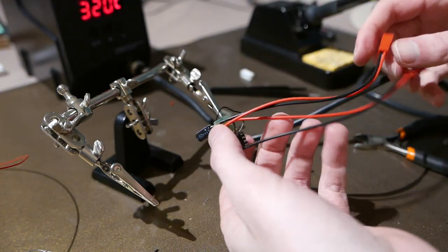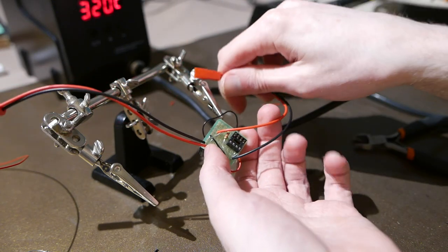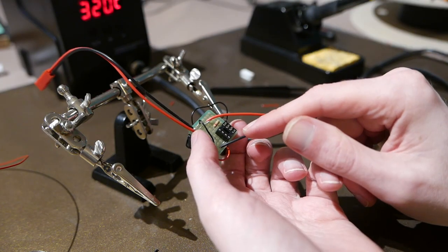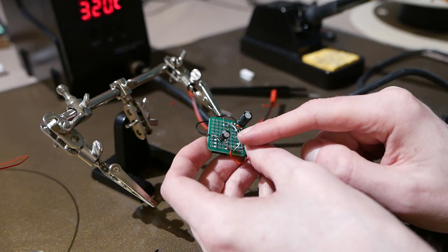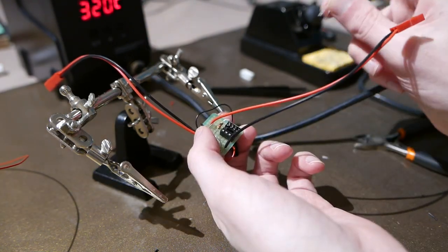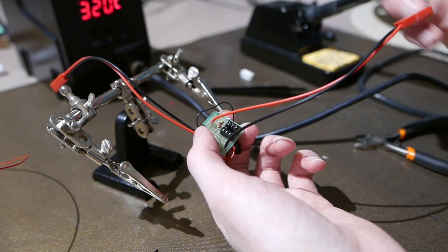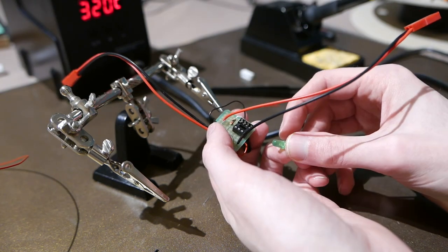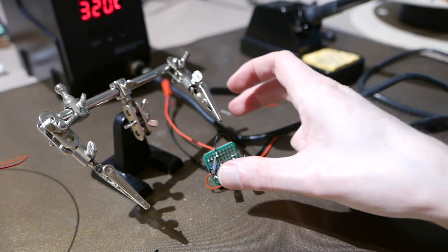So I have power to the motor here, power from the battery coming in here, capacitors on the battery, the flyback diode, and capacitors for the microcontroller. I'm missing four connections to the microcontroller, and I think for all of those I need to design the case first. One is the debug LED which needs to go into the case, the button needs one, and the soil moisture sensor needs two. So let's design a case that can fit this entire thing.